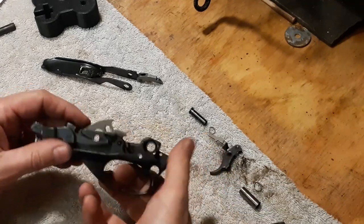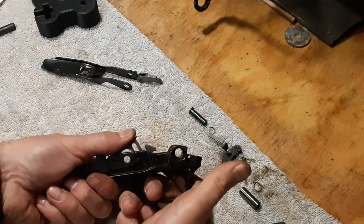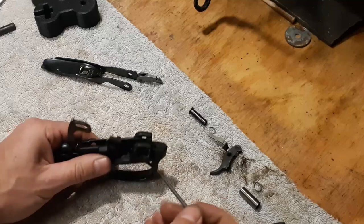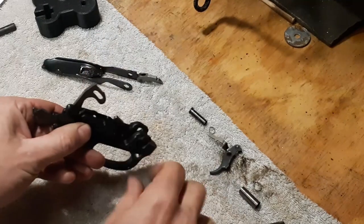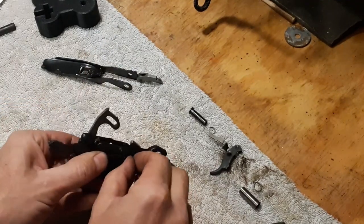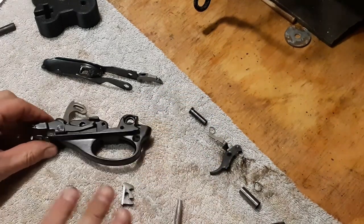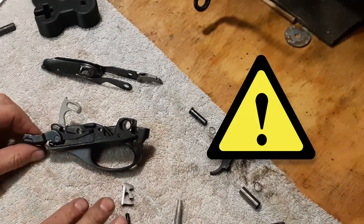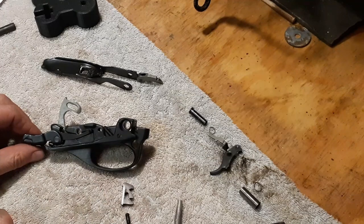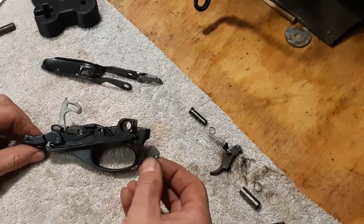I didn't release the hammer — I'm just going to put my thumb on top of the hammer, put a bit of downward pressure, pull the sear back with my thumb, and then I can slowly release the hammer. This pin I just reach inside — very easily just push that out — and the sear pin slides out the side, allowing me to remove the sear. Again, no real need to do anything with this. Do not adjust this, do not modify that — it was made at the factory very specifically. I think all you're going to do is end up making this gun very dangerous to yourself and others if you mess around with that. But if you need to clean it or replace it, that's how you do it.